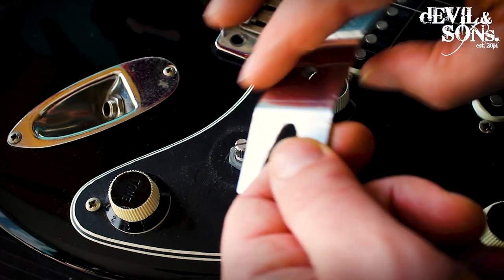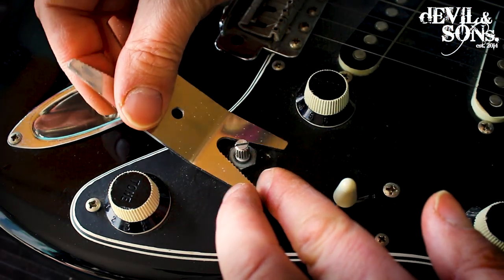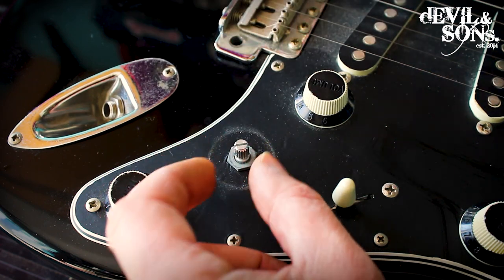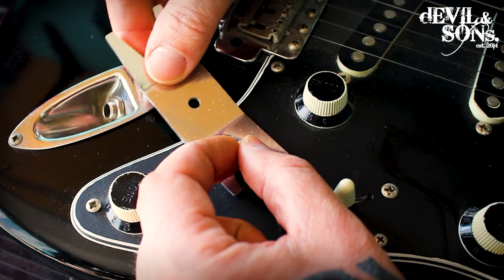As you can see, it will lock into any size nut and turn it. I'm going to hold the shaft when I turn it to make sure the pot's not moving underneath — turn the shaft to its extreme and then keep turning with this tool.